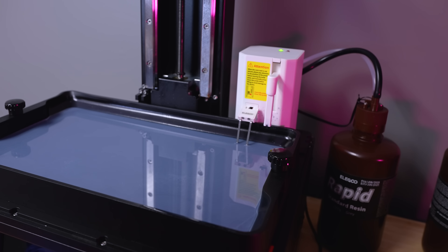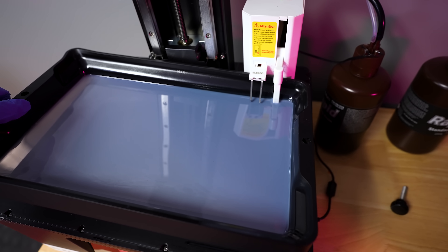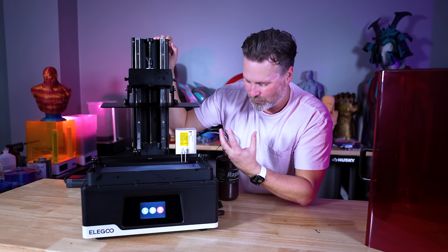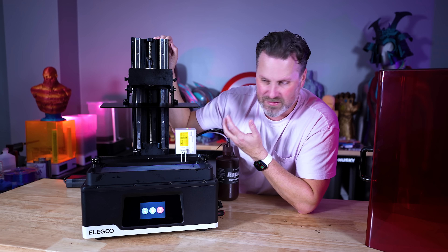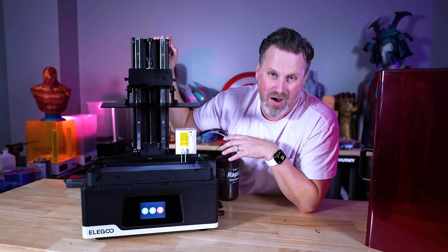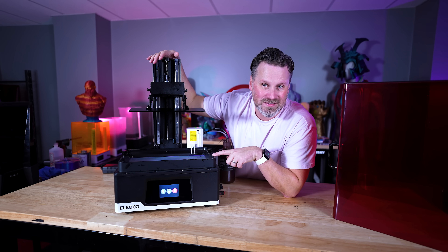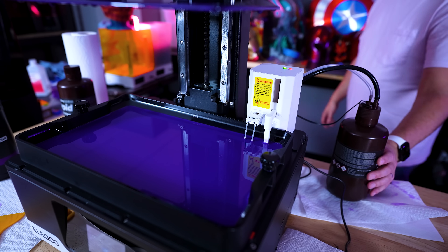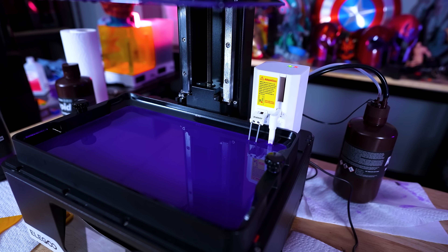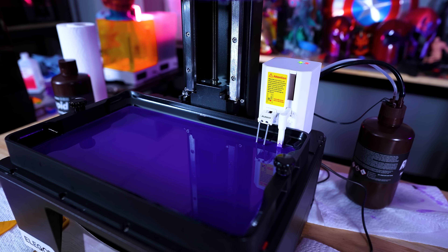However, what I have not seen — and maybe I'm completely wrong — but the one thing that's blown me away is the ability for this to not only feed resin into the VAT, but to auto suck the resin back out into the bottle. So when you want to empty the VAT, the system takes the resin, sucks it back into the bottle, and automatically stops once it's filled. That simplifies one massive area of complexity when working with any large resin 3D printer — specifically when you have a VAT full of resin and need to swap it out, as pouring it back into multiple bottles can be very cumbersome and messy.